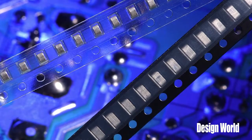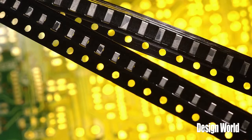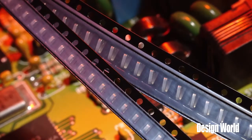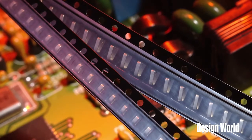That makes sense. Some of the jumpers I've seen don't look the same — why are there different types? One reason is that not all jumpers are surface mount devices. There's one style that looks like a small loop when it mounts on the circuit board. It's designed to be a means of realizing hard wire programming of circuit board logic. For example, you might put these jumpers on a multi-function logic card, then cut the appropriate jumpers to permanently set the configuration of the card. There's also a related device called the surface mount test point — it also takes the form of a loop, but it's designed so you can hook test probes onto it. It's relatively small, about the same size as a 1206 chip capacitor package.